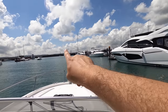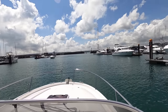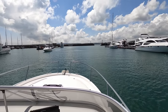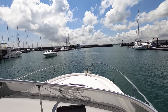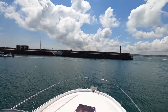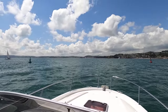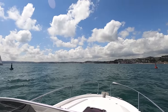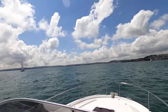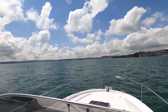This is Torquay Harbour — you can see a boat going out of the harbour entrance over there, that's where we're heading. In terms of rules of the road, generally if two boats are approaching you alter course to starboard — that's to the right — and that's why when manoeuvring in harbours you stay on that side and I stay on this side so we're not even in that position in the first place. People are generally pretty friendly and wave at each other. You'll also see red and green markers around the place — you keep red on the left and green on the right. They're configured for when you're coming into the harbour, so as you come out they're the other way around. In America they do it the other way around, so if you're boating in America check first.